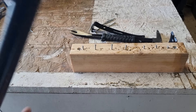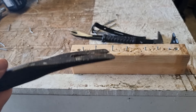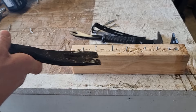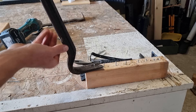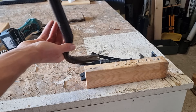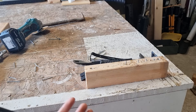If it's on the ground like a floor joist I always recommend using a larger bar. This is a sumo bar — it's got a nice thin end which helps it get under the nails, and I've never had any problems with it. I've bought crowbars in the past with a thicker end and struggled to get them under the nails. If you're working on the ground I'd recommend a larger bar because you need to apply less leverage and you can literally work your way along pulling out the nails one after another. It works incredibly efficiently on the floor.